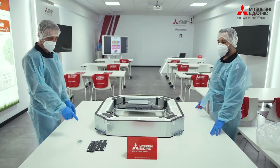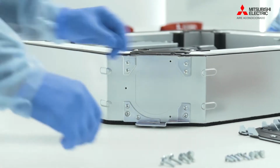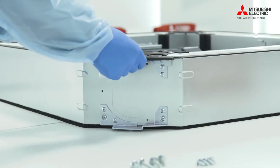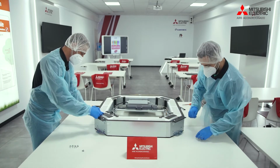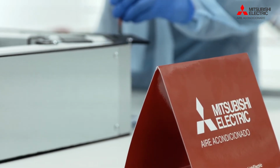Bear in mind this multifunctional casement is going to be going between the actual main unit and the actual fascia. Now I'm going to be showing this in a training environment, so bear in mind you'll be doing this into a ceiling void, so you need this extra height added on to the actual unit itself, so you may need to move the unit itself up to make that difference.